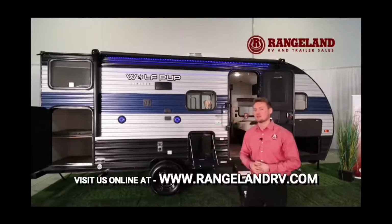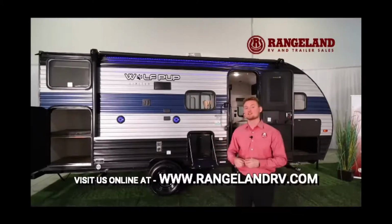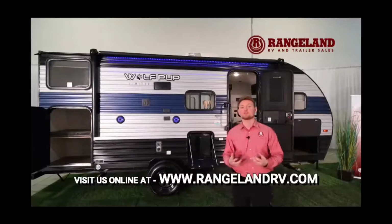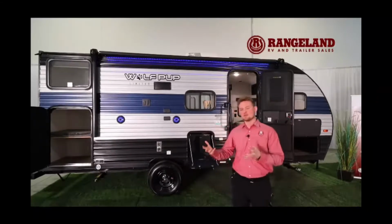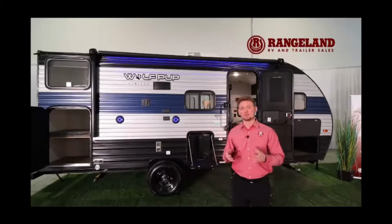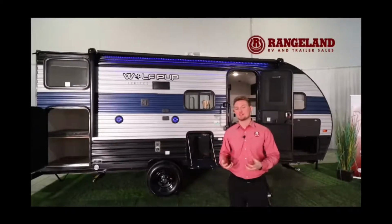The other thing that we'd like to talk about is that plywood flooring, like I mentioned. A lot of the competitors in our industry will use what's called an OSB, particle board flooring, chipboard flooring, you name it. It's that stuff that's just simply glued together, and it's a big problem in our industry, because what you generally will start to see is a lot of sagging in your floors, soft spots developing, because it easily absorbs water and it's just not as strong as plywood.